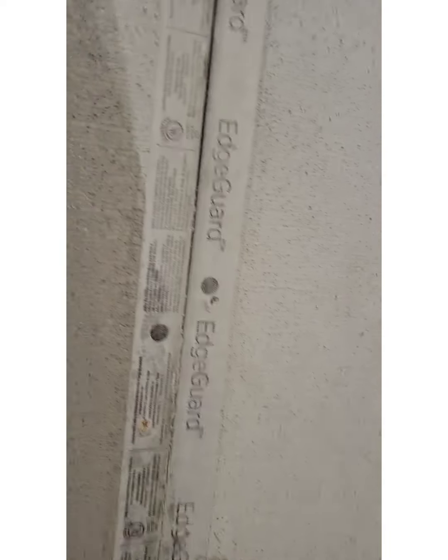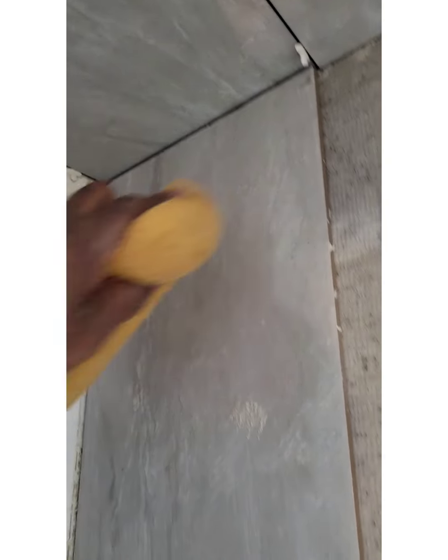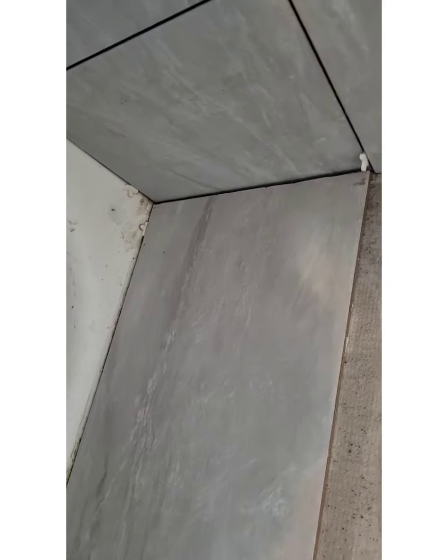All right, I got that side done with the edging in. I'm working on this side over here, going the other way. Remember, when you put your tile in, see I got my spacer at the bottom, remember, I hit mine like this so it can suck into the wall. Remember, wipe it off, put water on there. Don't forget to put tape in your seam. Keep your tile clean, because when you get ready to grout, you don't want to have to clean off all that hard thin set. That'll take a little bit of time.